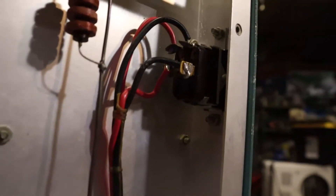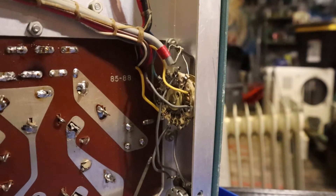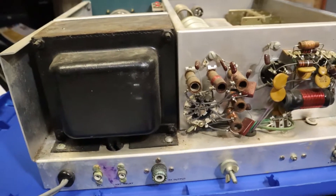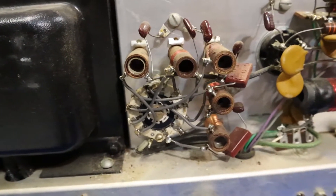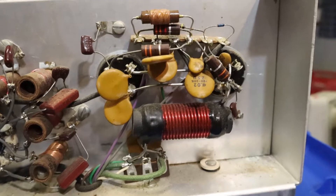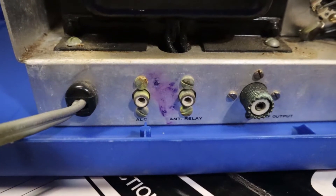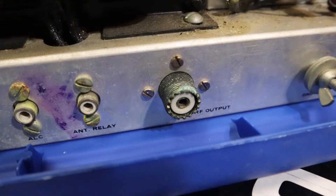The build quality looks really good in here. I'm going to clean it up as best as I can without disturbing too much. But installing the new power supply and the soft start breakers, I'm going to have to get in and start cutting away anyway, so there'll be a little more room for cleaning up. You can see the big old transformer here in the back and the band switching and coils. The connectivity in the back is pretty nasty — these connectors are all going to have to go. I've just got to get in there, get them out, put new stuff in, so no cleaning these up I don't think.